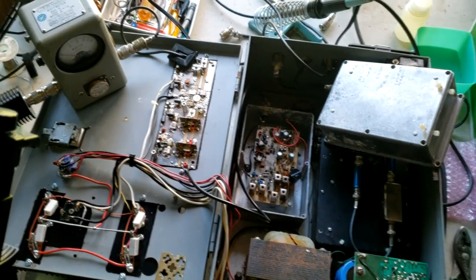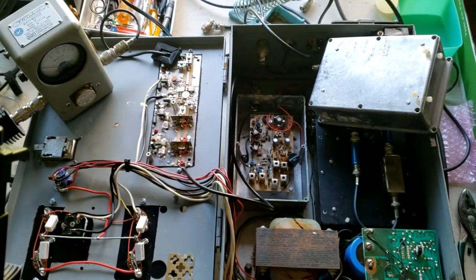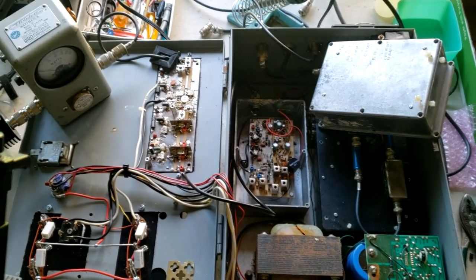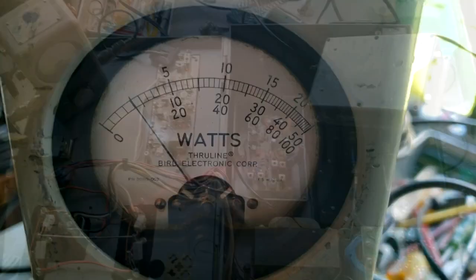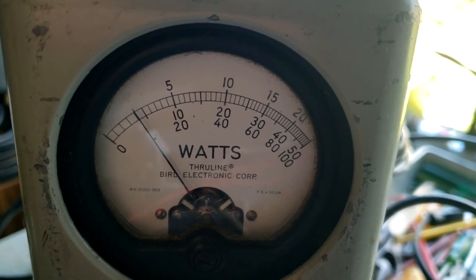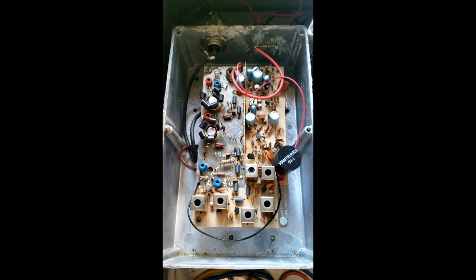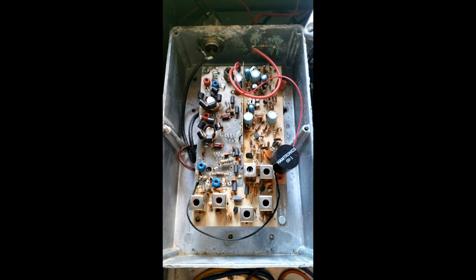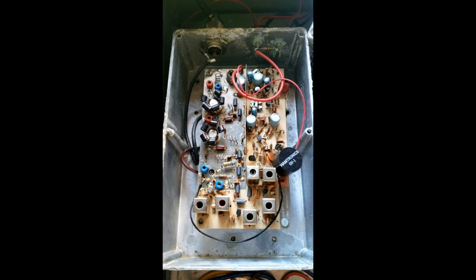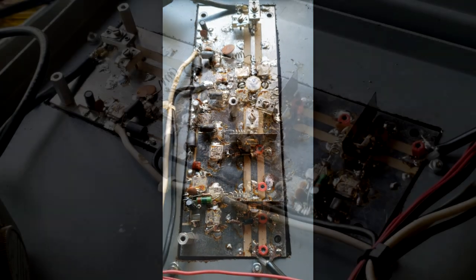This is the West remote receiver package. As we were working on it, tuning it up, we discovered it would not tune up properly to 20 watts or 25 watts. We were pulling about 4 watts where we should be at 20, 25 watts at least. I have checked the exciter and it is pushing a little over 1 watt, which isn't stellar, but not bad. So I am now looking at the culprit is most likely here in the power amplifier.